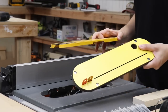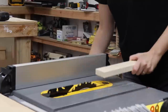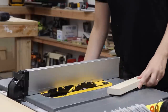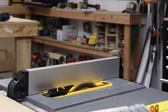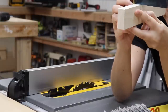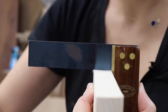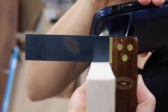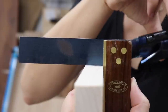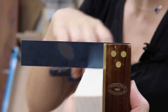I'm going to do a test between the stock plate and the zero clearance insert to see if there really is a difference in accuracy. I'm going to test on this piece of poplar — remember, my cutoff cannot be thinner than that gap when I test the stock plate. Looks pretty straight up right in the center. See if you can see this — you can't really see it unless you shine a light through. Do you see the light poking out through the corner next to the square? That's a little gap left over because the piece was pushing in towards the saw a little bit because the throat plate was flexing.